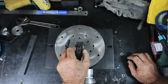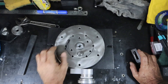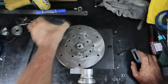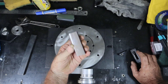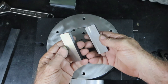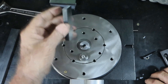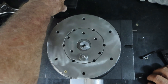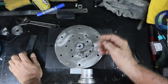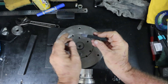I'll have to make sure I get these slots right or it won't work — or I'll put another hole in the table. Anyway, while I was waiting for everything to show up I got in and gave these a hit with the fly cutter. I've done all but the left one for you to see, and it's still a beautiful job as usual. So let's head over to the mill, fly cut that one, and we'll set them up — do all the slots, drilling, tapping the threads, and mill all the angles on it like this.